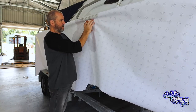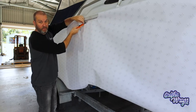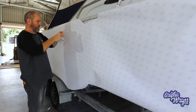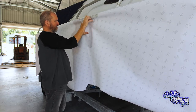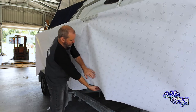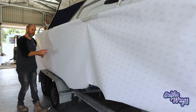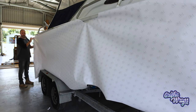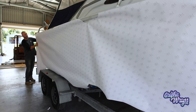That's stage one — just hanging it on the boat. It's not ready for trimming. The next stage sets it up to position the paper on the side of the boat. I want to take a little scoop out of my template so I can push this up and have some tension against the hull — nice and tight, nice and firm through there.